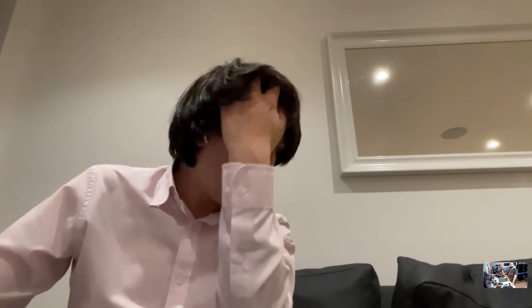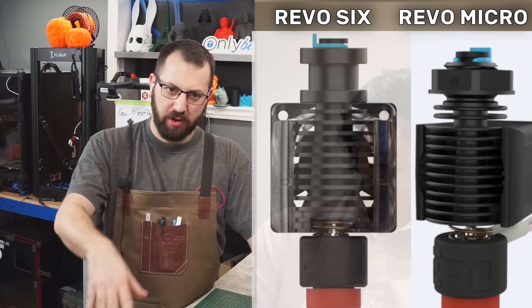And this is all in-house. Everything for this new heater — the machining — is done in-house from the bar stock. The actual heating element printing and sintering process is subcontracted out, but everything after that, including the machining, is done in-house right now. At launch you're going to have the Revo Micro and the Revo 6.